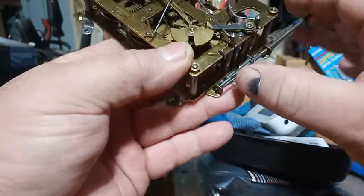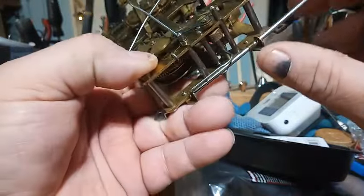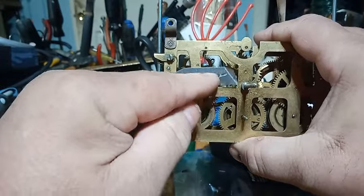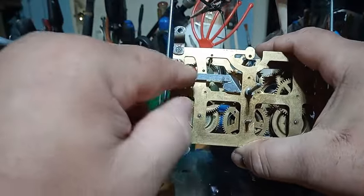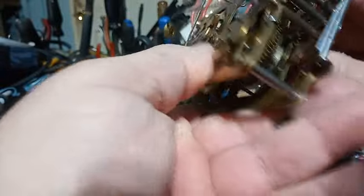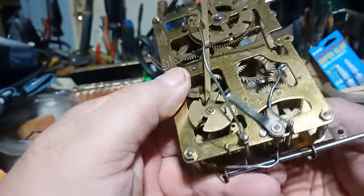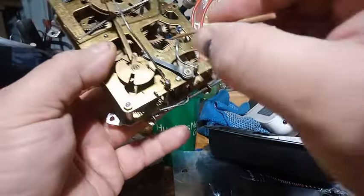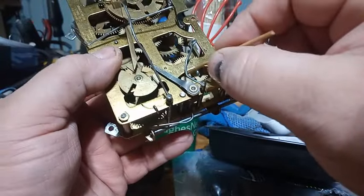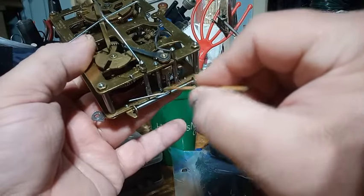This trip lever is what starts the bird into action. It is part of this lever right here. On an antique clock this would be a wire, but if I move this, you can see that it is part of this lever which goes into the count wheel. It is this lever which goes into the cam, and it is this lever which is that wire.